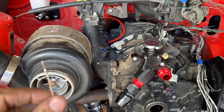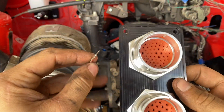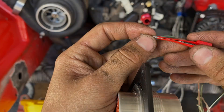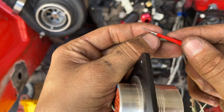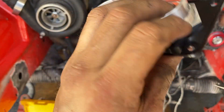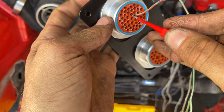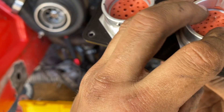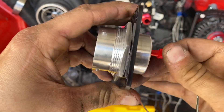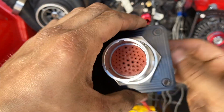The male pin will go on your stationary bulkhead connector, cannon plug, mil-spec connector, whatever you want to call it. Take this insertion tool and run your wire through it so the insertion tool is over the little bevel. Take it and wherever you're pinning it — I'm going to pin it at number three, which would be down this way — push it through. Once it clicks, you just pull it back, take it off. Both are in.